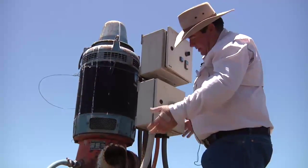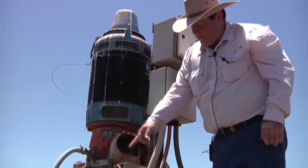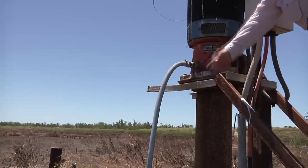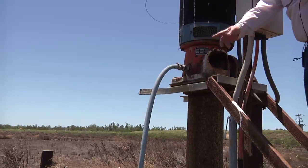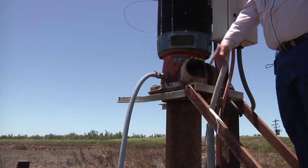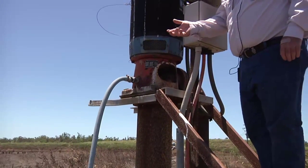The other area to look at is the pre-lube tank, which is a float away in this case. This hose here is normally connected to a small tank that puts water down inside the pump to lubricate the rubber bushes. It's important to make sure there's no sediment in there, because that sediment will wash straight to the bearing.